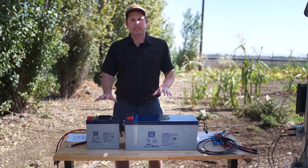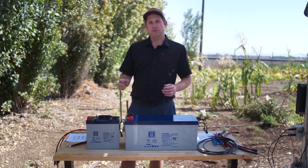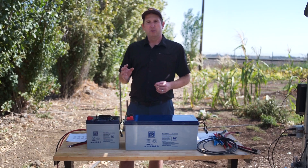These are 12 volt batteries, so when we're talking about a 24 volt or a 48 volt system we need to add them in series to hit our voltages. When we connect batteries in series, we connect the positive terminal of one battery to the negative terminal of the next — that's a series connection. The voltage is additive for each battery we add, so two batteries in series gives us 24 volts, and four batteries in series gives us 48 volts.